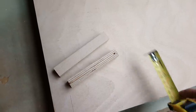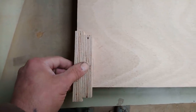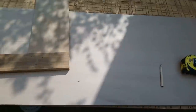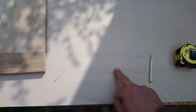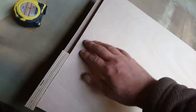This is the bottom piece and I need to cut one that goes in between the uprights. On my drawing I've made it 18mm, but most of this plywood doesn't come in at 18mm - it's close to 17mm. So I've cut two pieces, put them at the end, pencil mark, and I'll measure up to my pencil mark and cut one to that size. I'm using my homemade square - cut some grooves in it, old piece of oak, glued a piece of ply in and then ran it over my table saw. I know it's square because when I cut the first one I measured corner to corner.